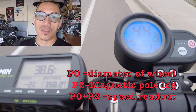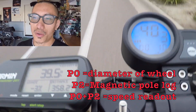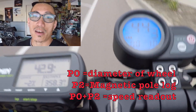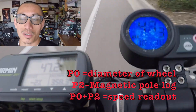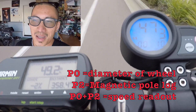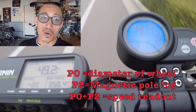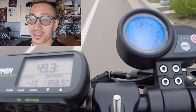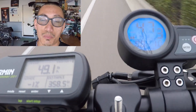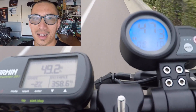The Mikey representative suggested setting P0 to number 10, but that did not give the most precise reading. Some followers in the comment section say set P0 to 7, and that doesn't make any sense because that number is too low — when you go to a higher end speed, the reading is going to be way off. So trust me on this: P0 to number 11, P2 to number 19.